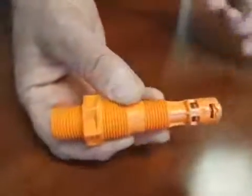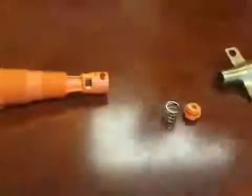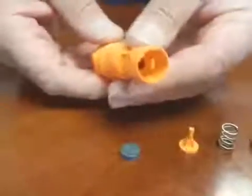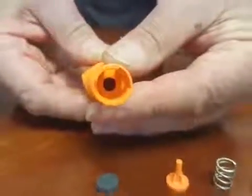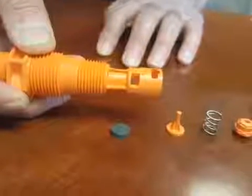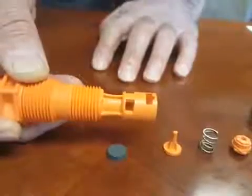The way this mister works: it has a cap, it has a spring, it has a plunger that holds the seal in place, and it has a Viton seal. The cap holds the spring, the spring pushes on the plunger, the plunger pushes on the seal to form a seal against the sealing surface on the inside of the mister. This mister is available with two different crack pressures — one version that will start emitting fluid at 9 psi and our standard version which starts emitting fluid at 15 psi.